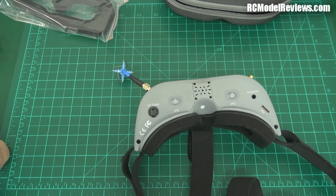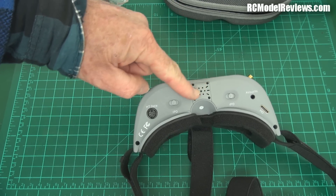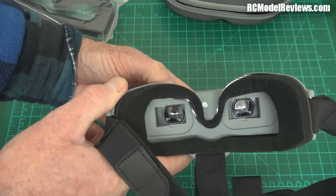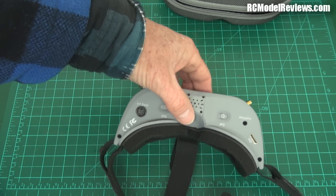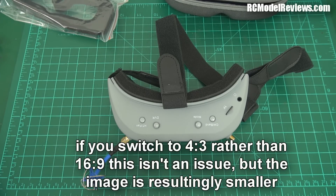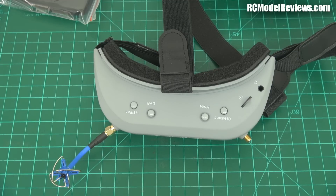I'll keep an eye on that. On the bottom, IPD adjustment - one for each eye. These are quite loose, there's not much friction, and they move the lens backwards and forwards. The optics have about a 32-degree field of view and they're working really hard - at the limits of what you can get away with. I end up with a little bit of fuzziness in the corners. Just like the Fat Shark HDs, they're very sensitive to placement on your face. I have to be very careful to get them lined up and play with the IPDs every time - it's not like Sky Zones where I just throw them on and fly.